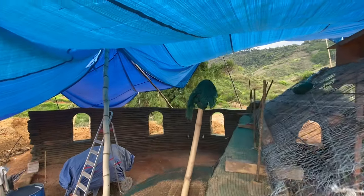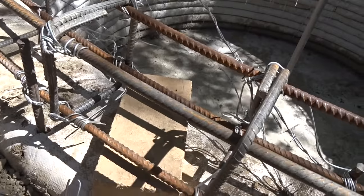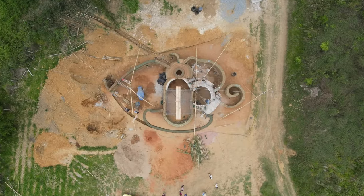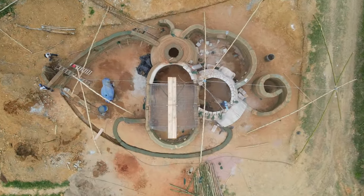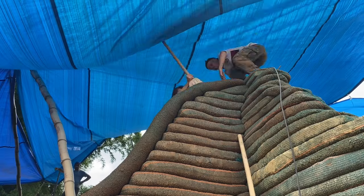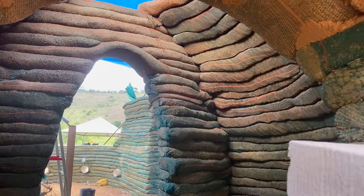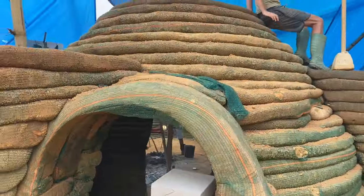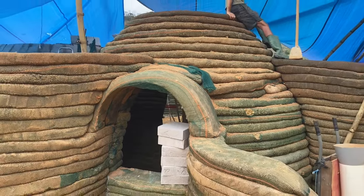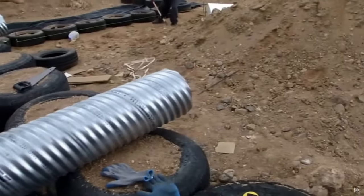Make the necessary details for the connection between the vaulted roof and the walls. Use buttressing, which are important structural pieces that keep the vault from popping out when pressure is exerted from above. Use hyper adobe for advanced techniques and finishing touches. Build a dome using hyper adobe including the window eyebrow details.